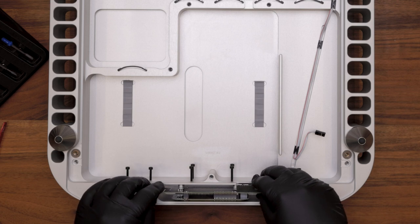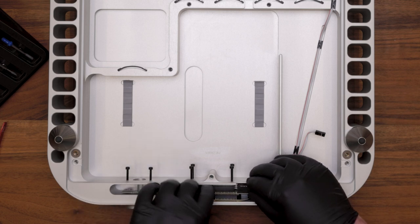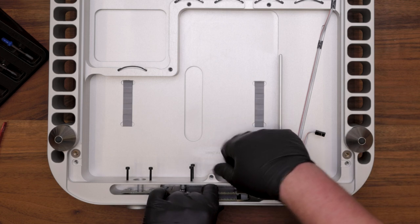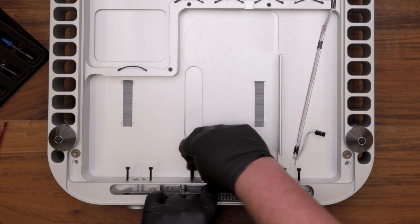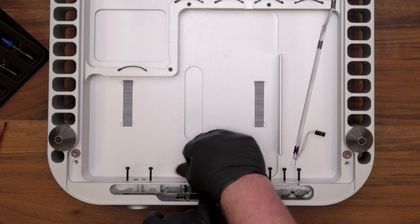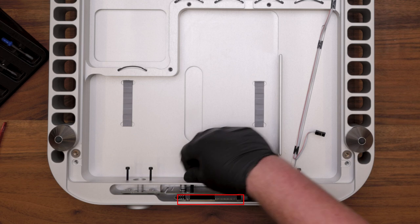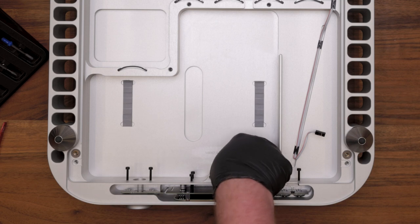Now, simply holding the mask in place, you can slide the display back into place and hold it firmly against the front until you tighten the screws. You can now gently tighten the screws by hand until they touch the board. You know the display will be installed correctly when the pinholes line up with the cutouts on the side of the display mask.